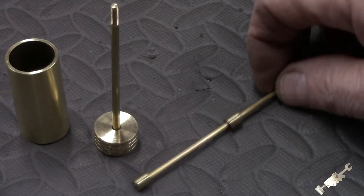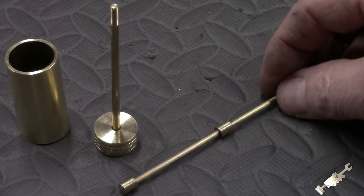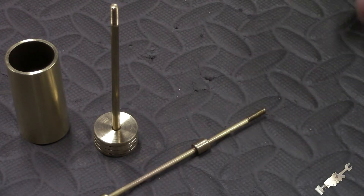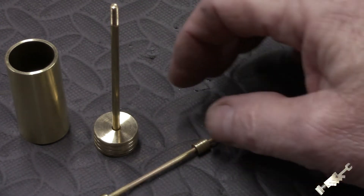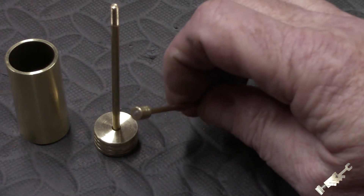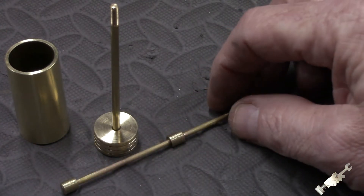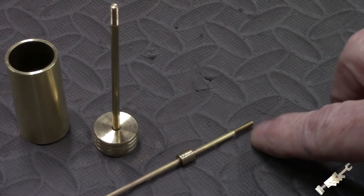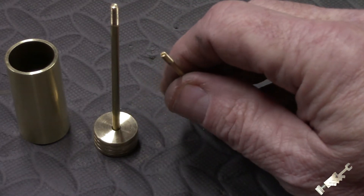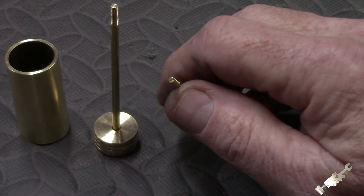This piece here is the slide valve. This slides up and down inside the valve assembly. It's just some — I think that was 5/16 OD — drilled with a 3/32 hole so I could put a piece of 3/32 brass rod in there and solder that on. There are some 3/8-48 threads on that, and I cut a little screwdriver slot in there to make adjusting this a little bit easier.